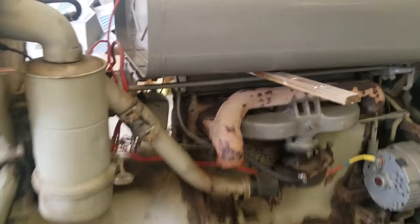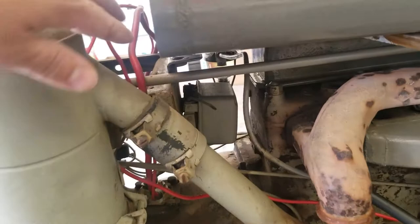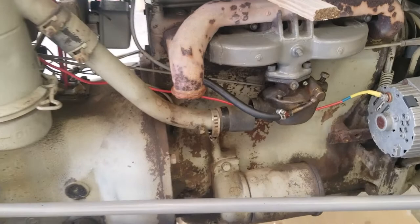What we did here is we're going to try to leave the tank on. Basically these two bolts right here go into the tank and hold it onto this battery tray. This battery tray is connected to the back half of the tractor. So we just took the bolts out and stuck a board in there just a little to wedge it up slightly. That way we don't have to remove this heavy tank or any fuel lines.